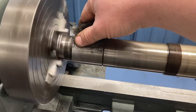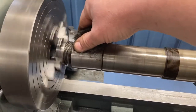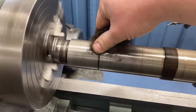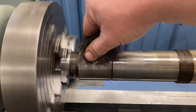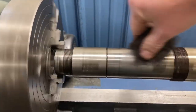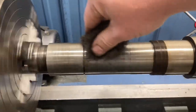As I get closer to the chuck I'm careful again - there's a key seat there and I can feel it in the bottom of the steel wool, but I'm basically just polishing. Keeping the RPMs low because I'm not holding the chuck super tight against the work - I didn't want to crush it down. I indicated it within a thou just for the polishing purposes.